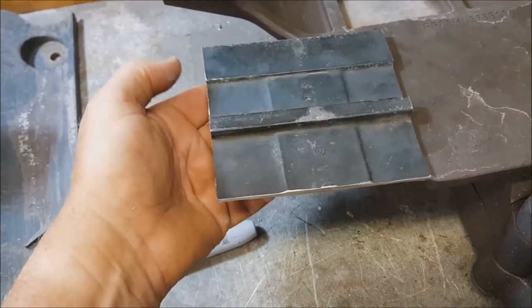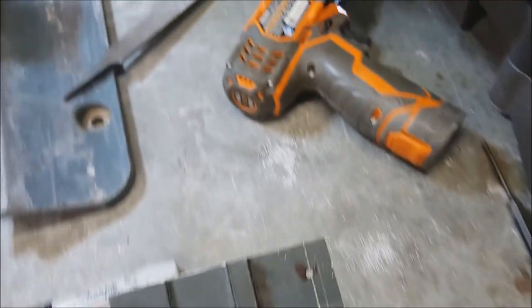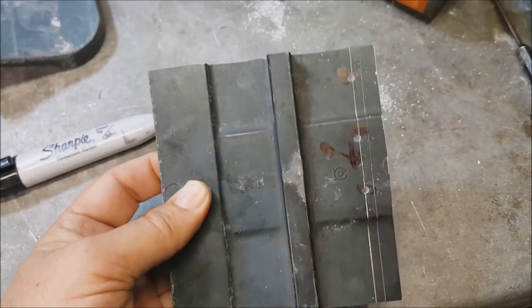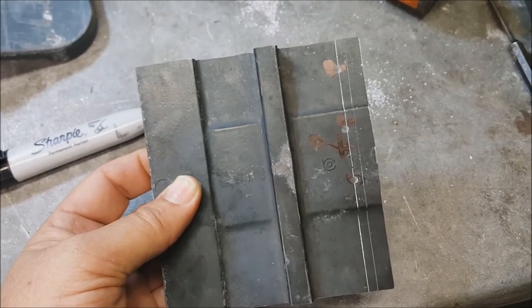Do yourself a favor, get a piece of paneling and the piece of metal that you're going to use. Use the paneling to do all the preliminary measurements, drilling, and work, and then when you get it all done and it's all buttoned up, take all that and transfer it over to the metal plate. Your work will be that much more sano.